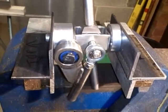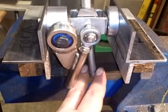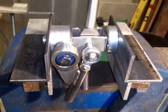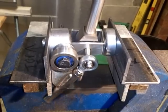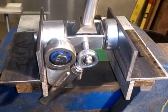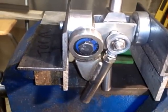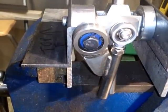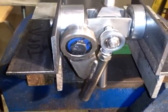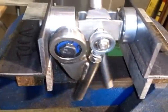So you can see the front and back motion. The lower half of the stick is providing the push-pull required on the cables, and if you twist the gear stick left or right it's activating that bell crank which I spoke to you about earlier on — you can see how that rose joint is working there. So as you pull over to the left it's pulling or pushing the other cable to engage the different levels of gear: first, second, third, fourth, etc.